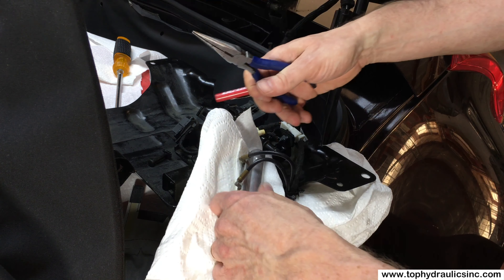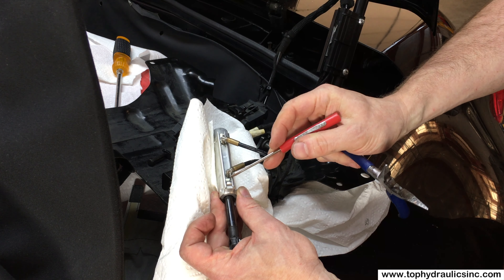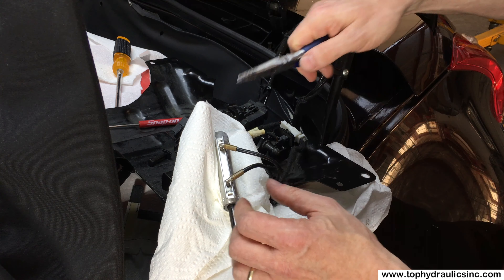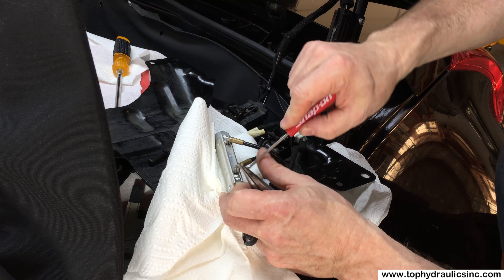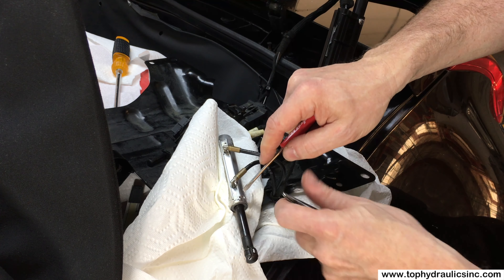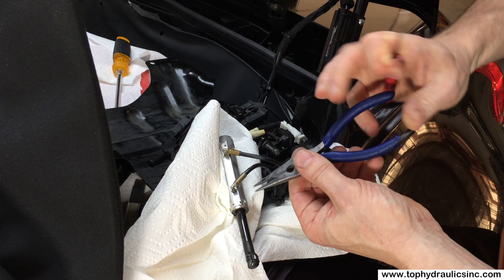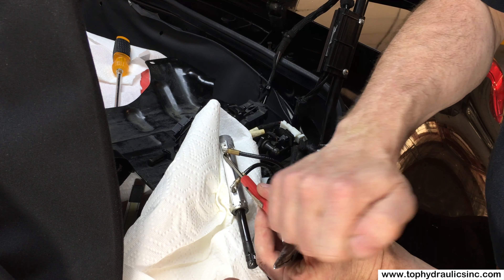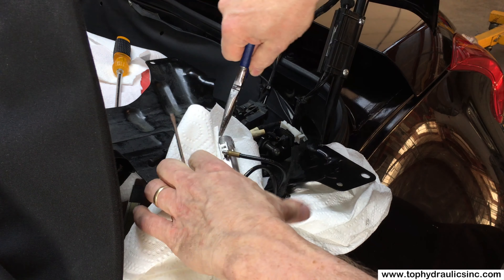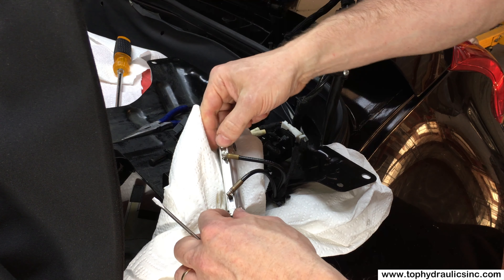A couple of ways to get these hose clips off. The hose fittings are held in place with two stainless steel clips, and those clips slide in the cylinder's rail. One way is to find the little gap between the fitting and the clip itself — that's the most elegant way to lever it out without bending the clip. The other way would be to tap at the end of the fitting and hope it slides, or worst case, take needle nose pliers and lever this way.